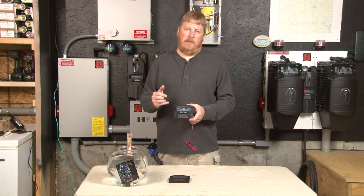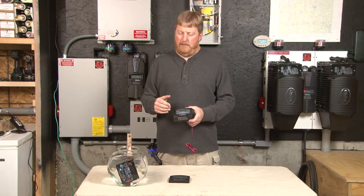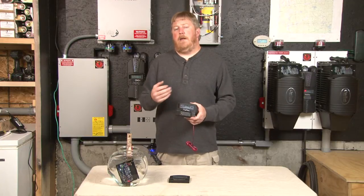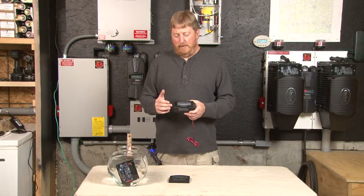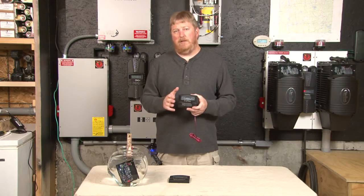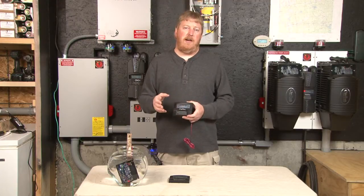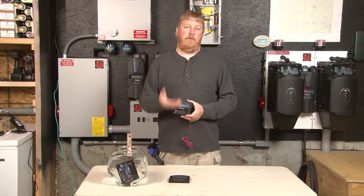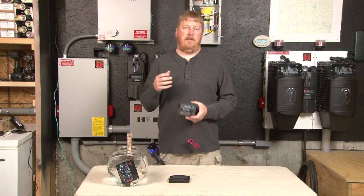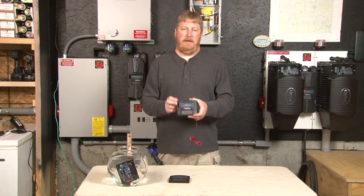When the light is green, that tells us the battery has recently been filled — less than a week ago the battery's been fully charged. If it's yellow or amber, that means it's been at least a week since the battery's been full. If it's red, that means it's been at least two weeks since the battery's been full. This is voltage and time based: according to the jumper setting you programmed, it will go up to a certain voltage, and once it maintains that voltage for a certain time, the green light will come on indicating the battery is full.